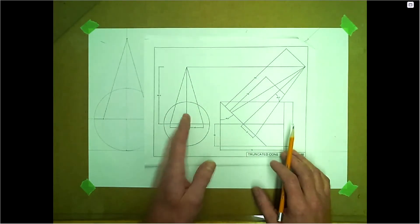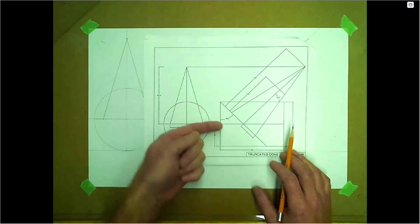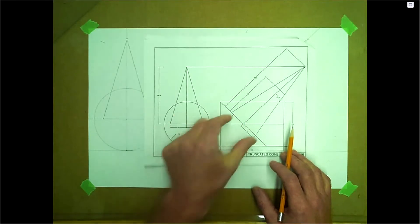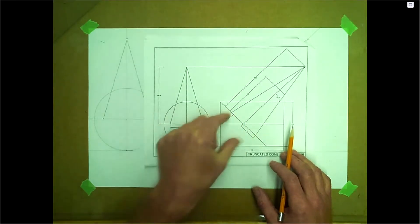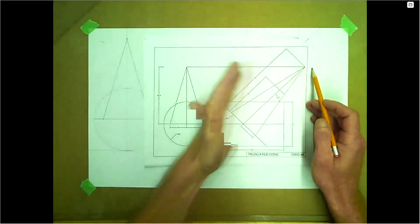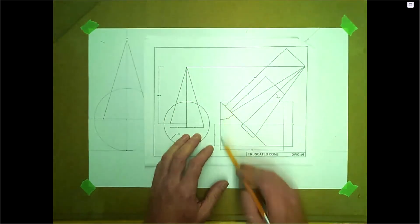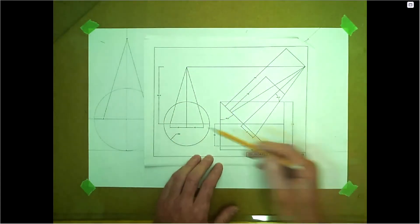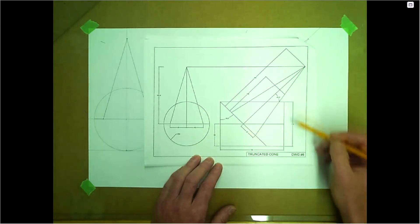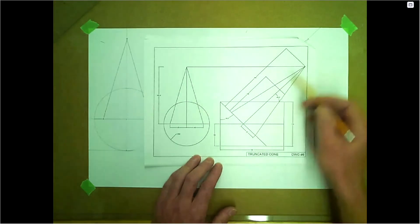So the front view looking down the cylinder, you're going to be looking at an elliptical shape. Your eyes would be looking through here in this shape, so we have to transpose all those over to the other side. Also this is sloping, so as this swings over, this will still be at the same height. This rectangle here is a circle — you can see this circle here. We have a 55 radius, so 110 for the diameter of that. We're 150 here, plus we have some heights and a 45.